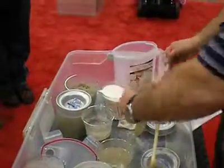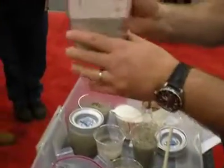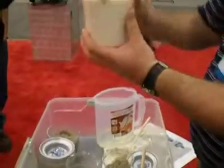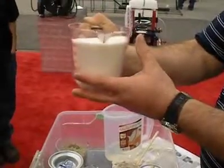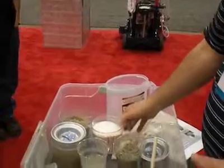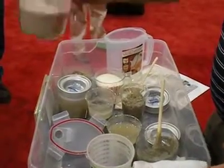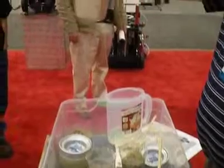The two products are called CFA, which is Concrete Flocking Agent by DITEQ Corporation, and CGA, which is Concrete Gelling Agent. What we've determined is it costs about 13 cents a gallon to flock the slurry, and about 80 cents to $1 to gel it.